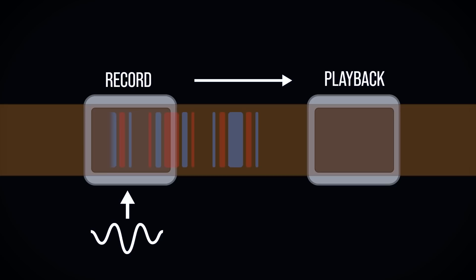So how do we turn a recorder into an echo machine? Well, this is only possible on recorders which have independent record and playback heads. The echo is produced due to the physical separation between the record head and playback head. It takes time for the recording laid down by the record head to travel the distance to the playback head — that gap in time is our delay, and the speed that the tape is moving through the device will change that time.